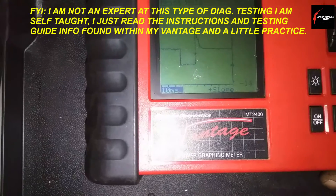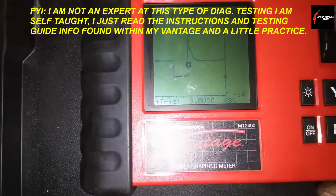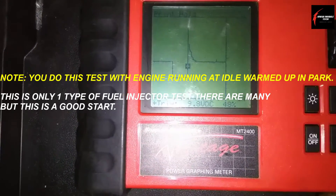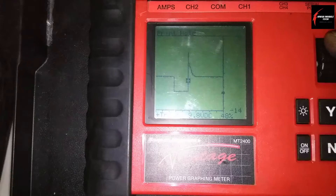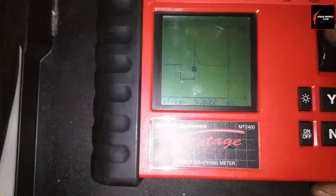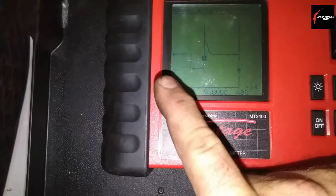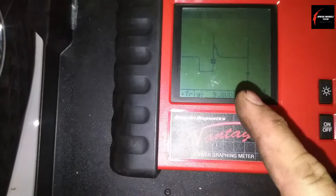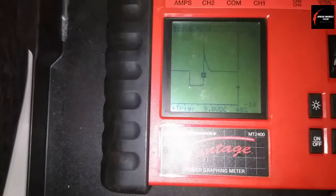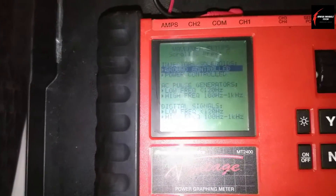Continue to scroll. The voltage I want to have set is 9.8 — if it goes any lower it doesn't show the waveform properly because there's not enough voltage showing. You want your trigger around the middle, so about 48 to 50 percent, so you can have a good view of your waveform. Once you've got all that set up you'll see the waveform.